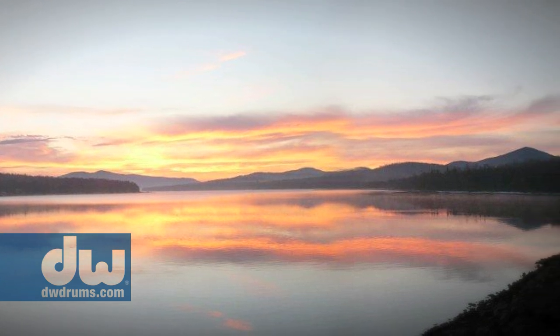So this project has got a number of beautiful things about it. Number one, the cells in this birch are so tight together because it's old growth timber. That means that the minerals have leached out of the cells, and the cells themselves are much smaller than normal wooden cells. So there's that quality about it. It's almost like tiny little echo chambers. Now it's birch, so birch has a very fast vibration and a very focused sound. So you get the musicality of the Sabian cymbals that are melted into the edge ring, and then you get the focus of the birch.